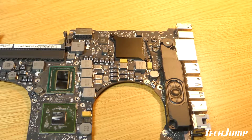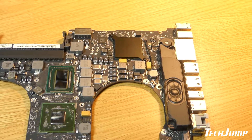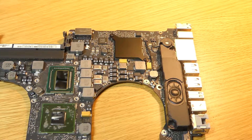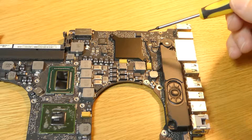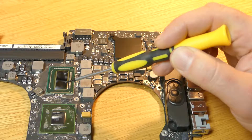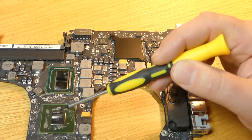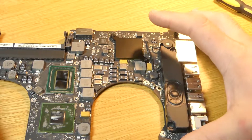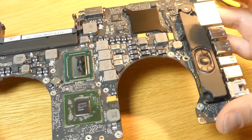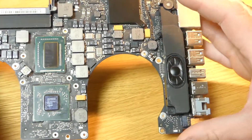Okay RetroFam, we have another Mac here. This is a MacBook and this is the motherboard. The problem is we have a black screen again and as always it's the graphic chip. This is the CPU combined with a GPU — it's an Intel CPU, and when boot is complete the Mac will initiate the graphics chip, the AMD chip here, and that's the problem. Sometimes they start to boot and when they try to switch to the chip to load the graphics drivers, they hang, they crash.